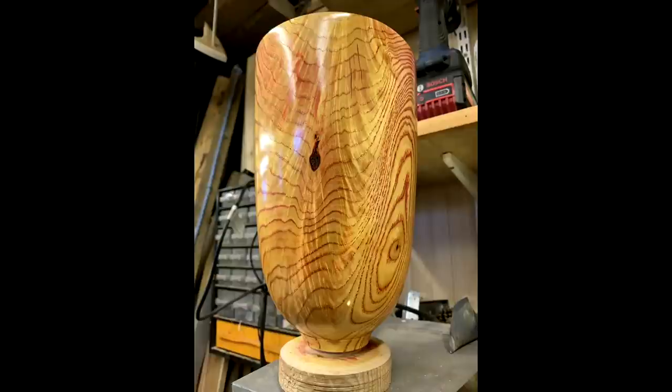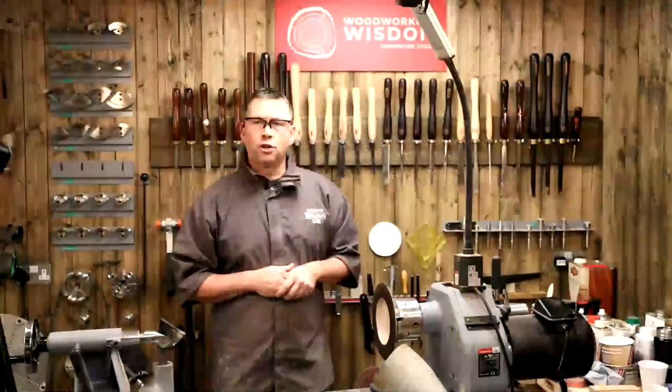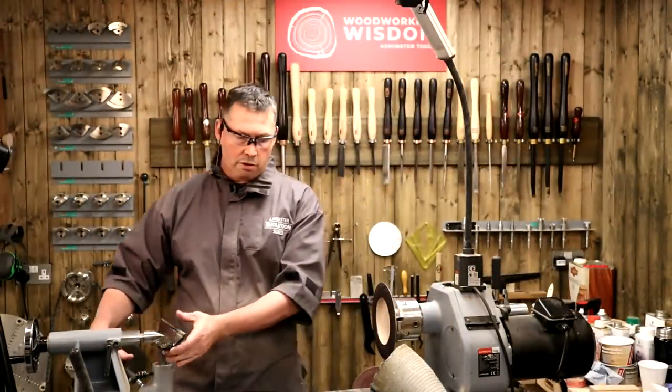Oh yeah, the ripples. So another type of effect on timber. Rippling is beautiful. This is a bit of rippled ash, quite dense ash. But again, same issues there. I wanted the color to emphasize the rippling and make it really pronounced. That's bare. There's no lacquer on top of that. So I went with a satin lacquer after that, just so it kept it woody and not looking too plasticky. And I think sometimes if we add too much gloss to things, they can get a little bit plasticky. I didn't want that. So there, it's just using color to promote that grain, to show that grain.